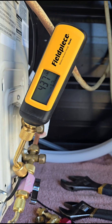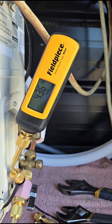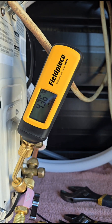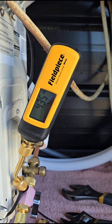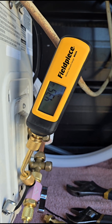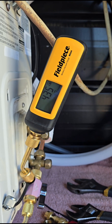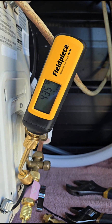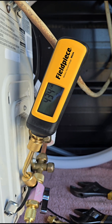It's been a half an hour, and yes, it is below 500 microns — not by a ton, but it may hold right there. I would not stop at a half an hour though. We know that these machines will pull it down now; we don't know how much more. We're going to give it another half an hour to find out. So we've got a half hour in, we've got 435 microns. If you have a tight system, that's what yours will be too. This is a really small pump and I'll give you the details in a minute.